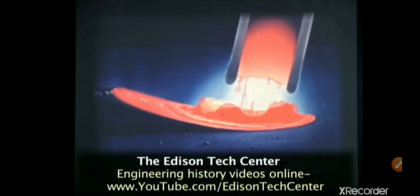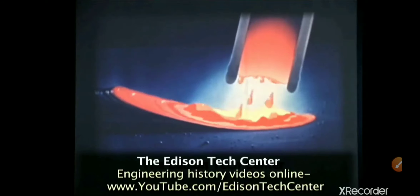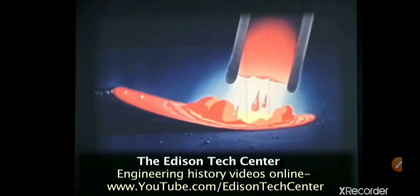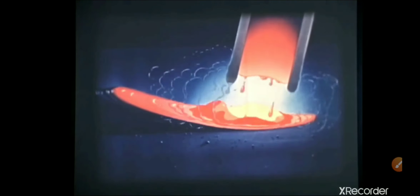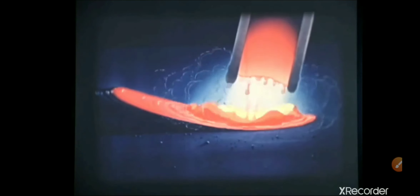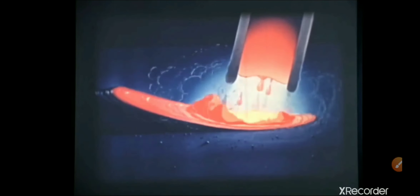The movement of metal toward the rear of the crater and the depth of the crater are excellent checks on the quality of the work. At the same time the metal is melting, the coating on the electrode is being consumed — slower than the electrode itself — which shields the arc and helps direct the flow of metal, permitting higher currents and faster weld metal deposit. A gas is formed, covering the arc with a protective shield that prevents exposure of the molten metal to air and prevents the formation of harmful oxides and nitrides. Chemicals from the coating act as cleansing agents, removing impurities that float to the top and form a slag coating over the bead upon cooling.